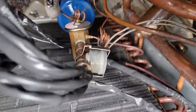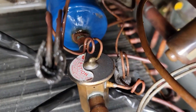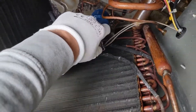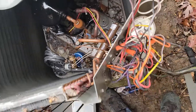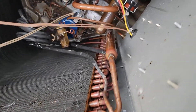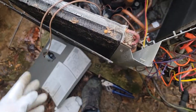Got the top off of the unit and here is the defrost thermostat that we're replacing. It's located in between that distributor and the expansion valve. We're going to go ahead and take that off. It's pretty easy to take off. Got the wires loose, so should be able to route it through there. Got a couple wire ties I have to take loose.